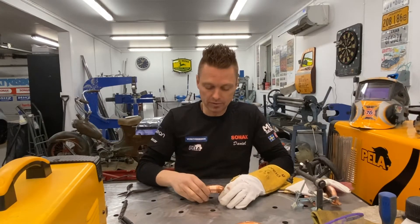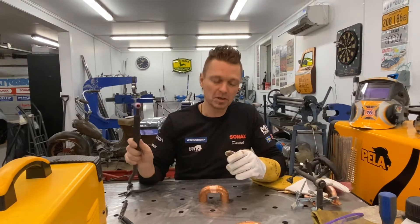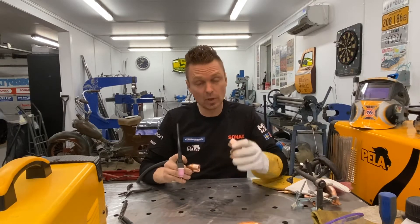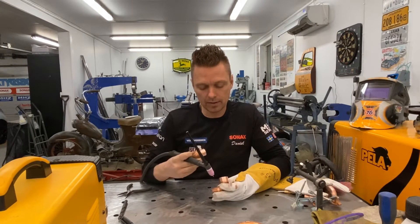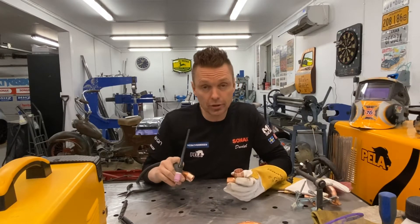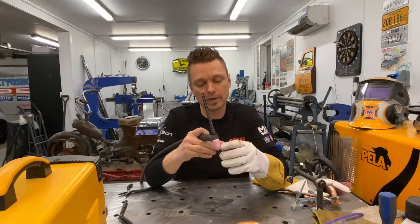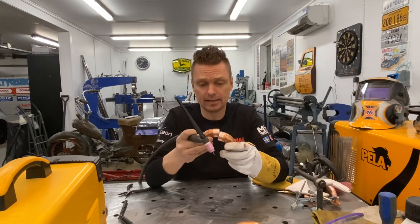The only thing that you have to do is have a much higher amp on the welder. I'm going to use one millimeter thickness of copper. So if this were stainless steel I would probably use around 30 to 45 amperage, but when I'm going to weld this I am going up to probably 180 to 190 amps.